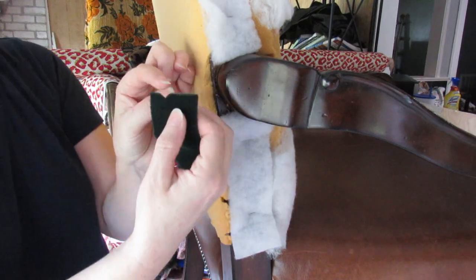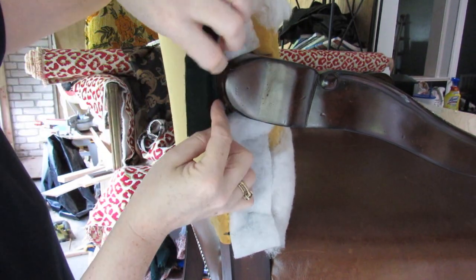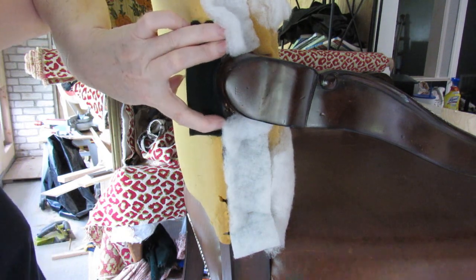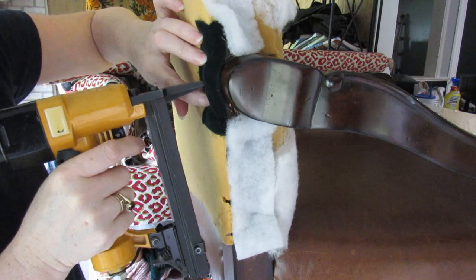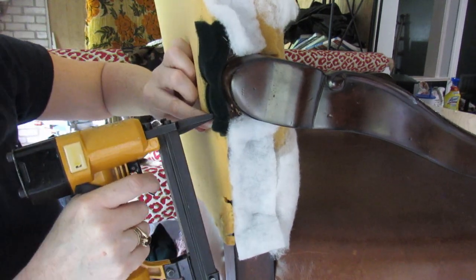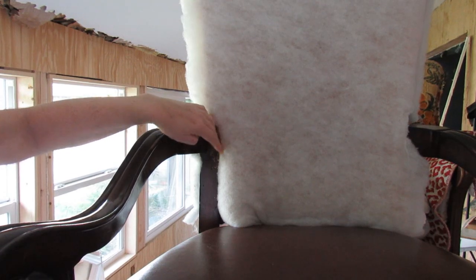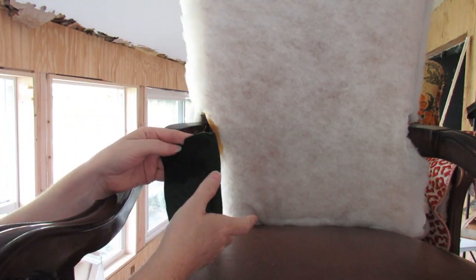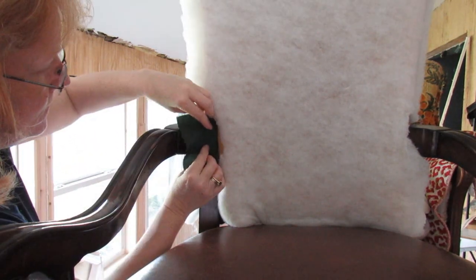On the outside arm, I've got my mark telling me which way is up and down. Fold it over slightly, press it up against the back of the chair arm and staple at the bottom and at the top. Pull out to the back — I usually do three times and I go crossways. I've managed to roll this foam back and catch it. Then with the fabric — this is the right side — I'm now going to put it with the back side towards the back of the chair.